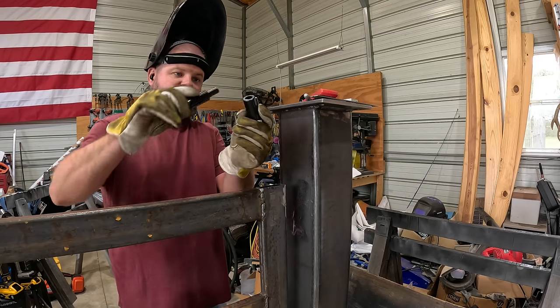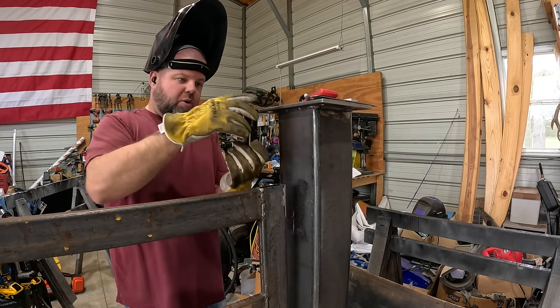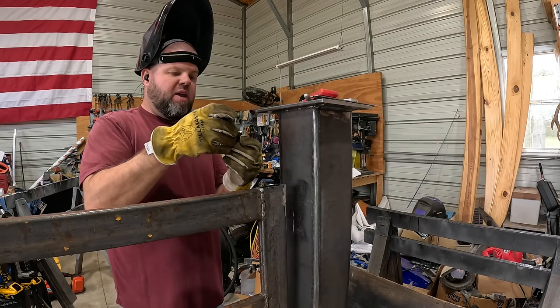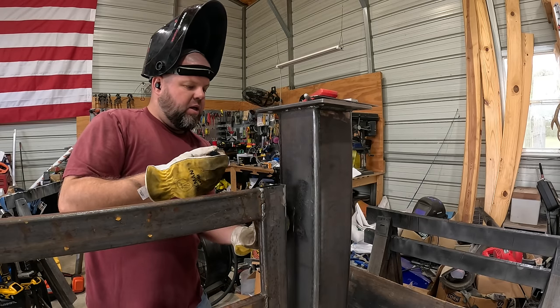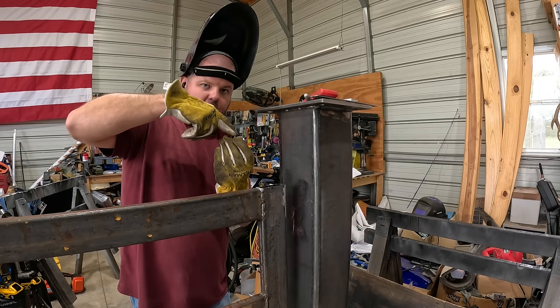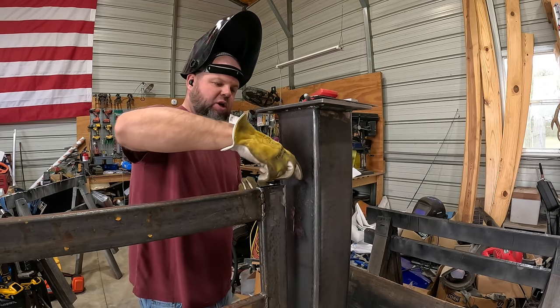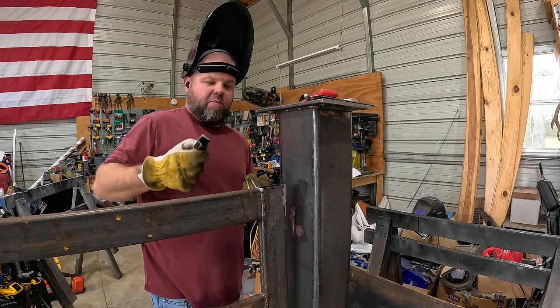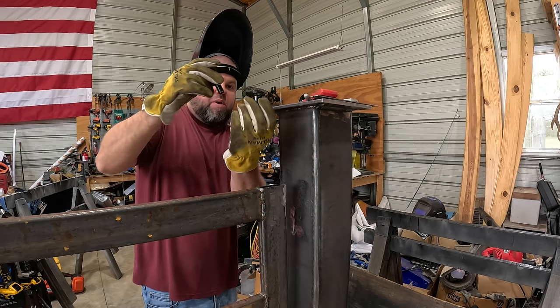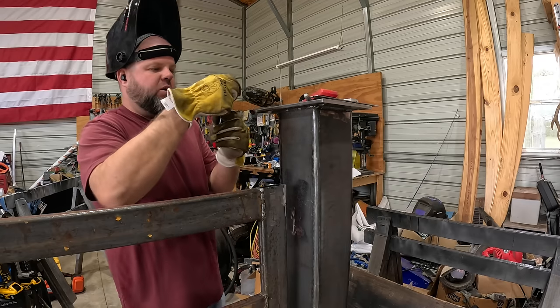All right, so before I weld this hinge on, I'm gonna go ahead and put the ball bearing in there because that allows me the proper spacing. And we're gonna put the open hole side on the gate facing upwards. That way it'll hold the ball bearing in, it won't fall out on the ground. We're gonna put the pin side of the hinge downward facing on the gate because whenever we're trying to lift, put this on, we wanna be able to see that open hole and line this up and drop the gate down into it.